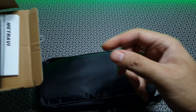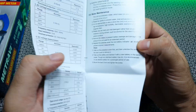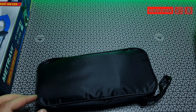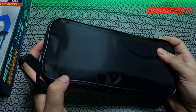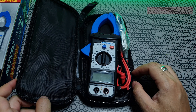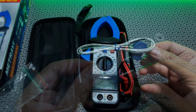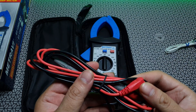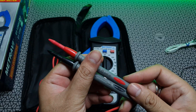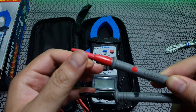Inside there is a beautiful pouch and a nicely printed, good quality color paper manual that has everything listed neatly inside. This carrying pouch feels premium, and it should be given that this is a fairly expensive instrument. Inside we have the clamp meter with all the cables. What stands out is the temperature probe — this clamp meter can also check temperatures and has heatproof sleeving all over it. The test leads are really good quality, highly insulated, rated at 1000 volts, certified CAT 3, and have protection for the lead tips on both sides of the cable.